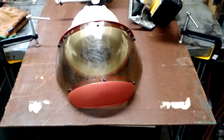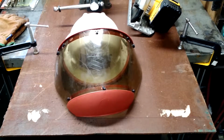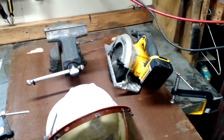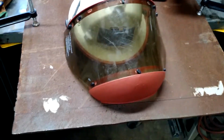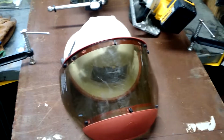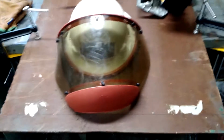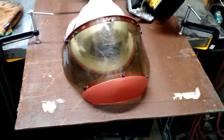Alright, cutting this plate with a circ saw is going to throw a ton of hot chips all over the place. Especially since that saw is like 5,200 RPM. Way too fast for what you're supposed to use. So you're not saving any money if you blow it all in the emergency room, so wear a face shield. It's not any fun to have somebody digging metal out of your eye. I'm definitely wearing a long sleeve shirt too. And pants. Hot metal chips are no joke.